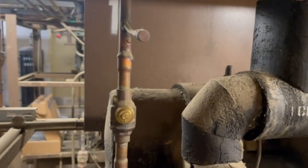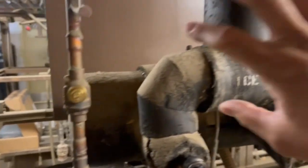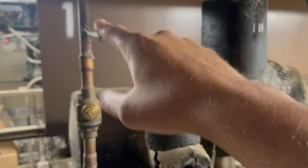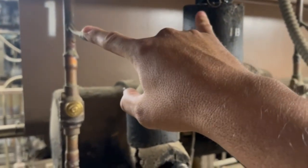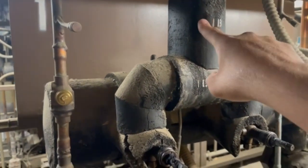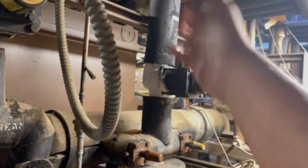What I'm doing is cutting off the liquid going into my cases on the sales floor and it's just going to evaporate all that liquid. It's going to come back as vapor, and once the pressure equalizes I'll know I've got nothing but vapor. Then we'll go in the process of pumping the vapor that's left into my rack - the rack will still be running.